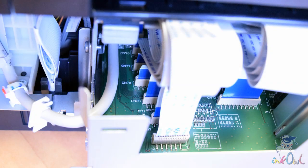On the left-hand side of the motherboard, there are several ribbon connectors, each labeled and plugged into corresponding sockets. Our goal is to bypass the connections CN76, CN77, and CN78, and instead connect those inputs to our chip decoder.